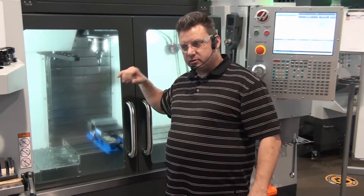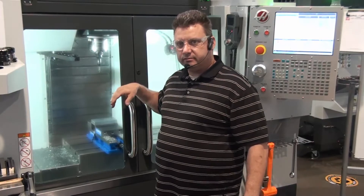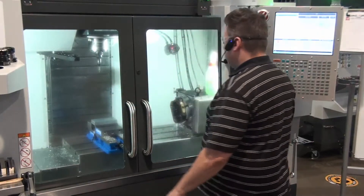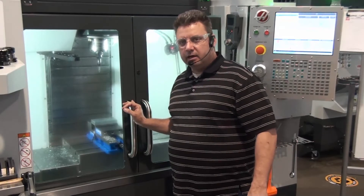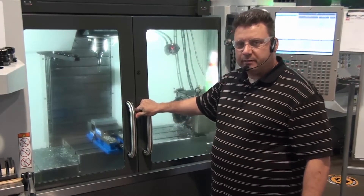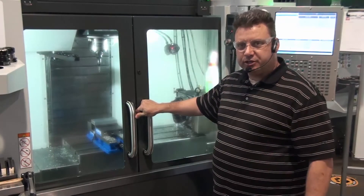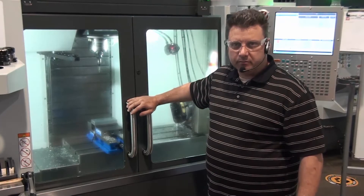When doing this with the doors open, do you have them with the doors closed? Doors open, so 750. Now that we put the tool in, we need to set the spindle speed. We're going to do this with the doors open, so the maximum spindle speed the machine will be set to is 750 RPMs.